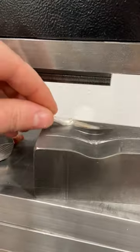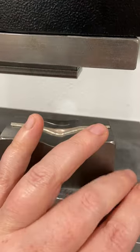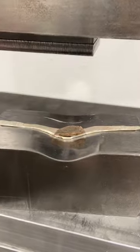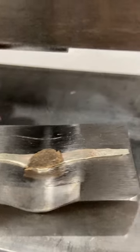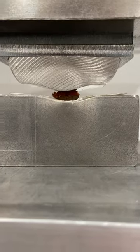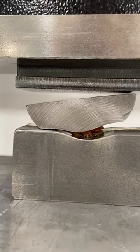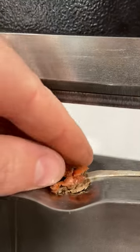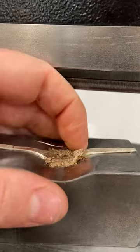After pickling, cleaning, and drying I'm ready to put it back in my impression die and repeat all of those steps that we did before. This time I'm adding an additional pusher — a small clump of brown paper like a brown paper bag — and it's going to act as a slightly more solid pusher than the urethane, because the urethane flows under pressure and takes the path of least resistance, while this paper is going to act as a more solid force behind the metal.